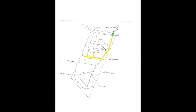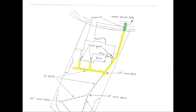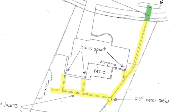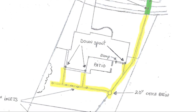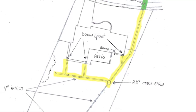Here's our plan. In this video, we're going to complete the trenching from the street to the first large catch basin. We will tie in the three downspouts and the sump pump discharge. We will install the first set of inlets and 20-inch catch basin. That basin may look low for now because we've set it 2 inches below the level of the patio. In the next video, we'll install the rest of the catch basins and inlets, plus all the gradient and swales.